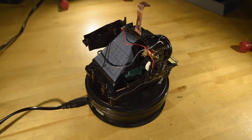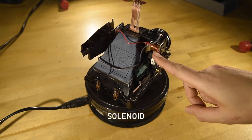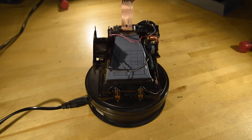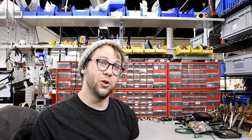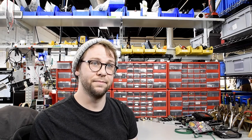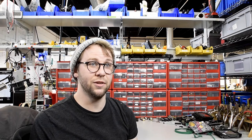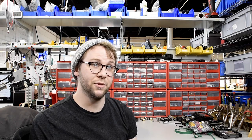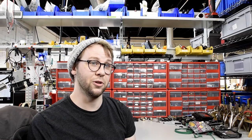For that, I went to talk to Brian, our head of repairs. There's a solenoid in the 600 camera that controls the opening and closing of the shutter blades. When one takes a photograph, the solenoid energizes and allows the shutter latch to disconnect from the walking beam. The solenoid then de-energizes to allow the shutter blades to open via their spring tension. Once the exposure is deemed complete, the solenoid re-energizes and pulls the shutter blades shut, relatching them closed and ready for the next cycle. To make the camera continuously cycle, one increases the gap between the end of the solenoid plunger and a screw at the end of the solenoid. The blades can no longer close appropriately, which causes the camera to think it needs to keep cycling in order to close the blades.